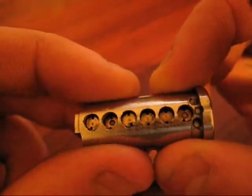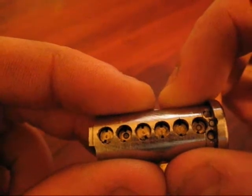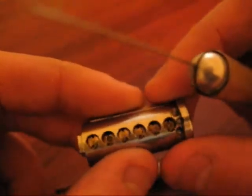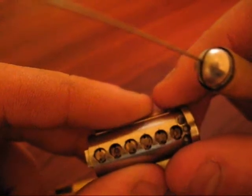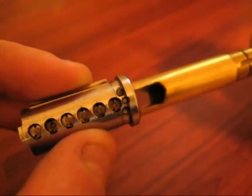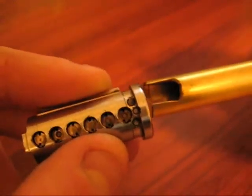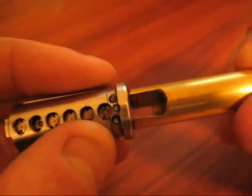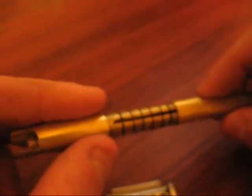So we know those pins and the grooves where they need to be at the end of the day. We know that they're evenly spaced. We know the spacing is .17 inches between each one of these pin centers. So why can't we just use that information to open any Medeco sidebar? Well, the answer is we can. We need a common reference point that's not going to change between locks — I like the front of the plug face. It's convenient, it's right there, you're not going to miss it. So by butting the tool up against the front of the plug face, hooking into the sidebar grooves, and comparing their positions with the pre-measured positions — these are pre-measured from Medeco specs — and then moving the pins to correct them into alignment, you can pick the sidebar.